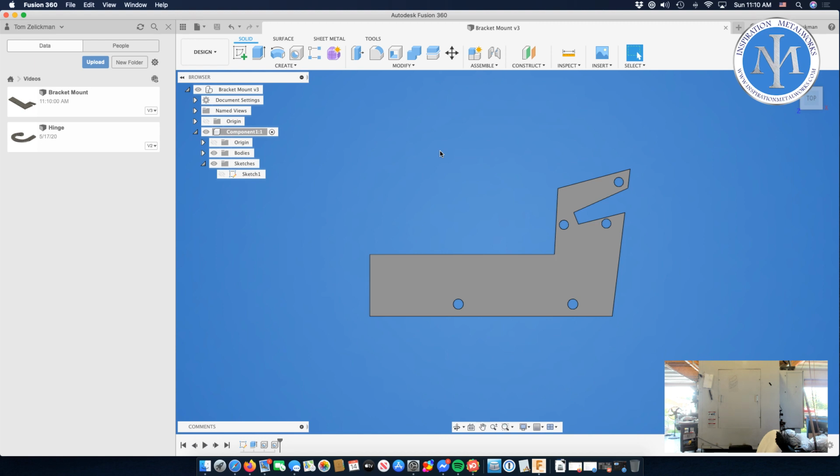That's snap gauges, radius gauge set. Okay. And the nice part about this is this doesn't have to be exact. There's some relative measurements that need to be correct. And then the areas where I do need to be really careful is this part, right? So these mounts, this needs to be in the right place. This needs to be in the right place. And I believe relative to each other, they might need to be in the right place. But the rest of this, I've got some leeway on.